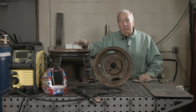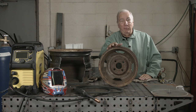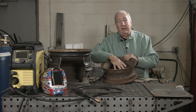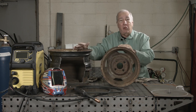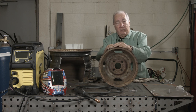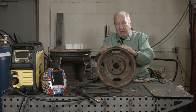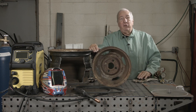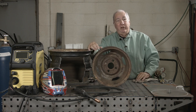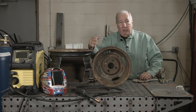We've completed the fire pit portion of our outdoor grill. Now the next thing we're going to work on is an ash collecting piece. We're using another rim — this one happens to be a 14-inch rim — that when sitting down, the fire pit will sit right on top of it. We don't have to attach it because the weight will keep it in place. This will collect our ashes so you can have this on your patio without ashes all over the ground. Since it's a rim there's a hole in the bottom, so we're going to cut a round piece of sheet metal and drop it in here and tack it in place so it actually catches ashes. I measured the inside diameter where I want the piece to sit and it turned out to be 11 inches.